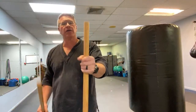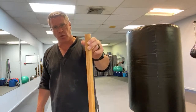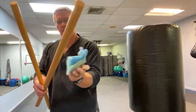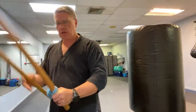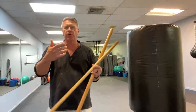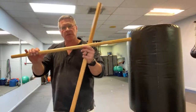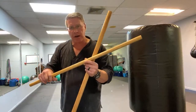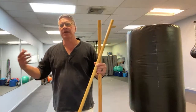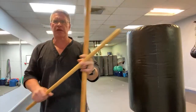When you start to use the homemade self-defense walking stick, you want to oil it every single day for the first couple of weeks - that little bit of oil is enough to start soaking in. That oil is going to make it flexible and strong again, because when they kiln dry it before it comes to the hardware store, they suck all the water out so it doesn't rot and doesn't attract bugs. When you get it, it's going to be dry and brittle - sand it down, oil it up every day for a couple of weeks. Then do it every couple of weeks for two or three months, then twice a year or as needed.